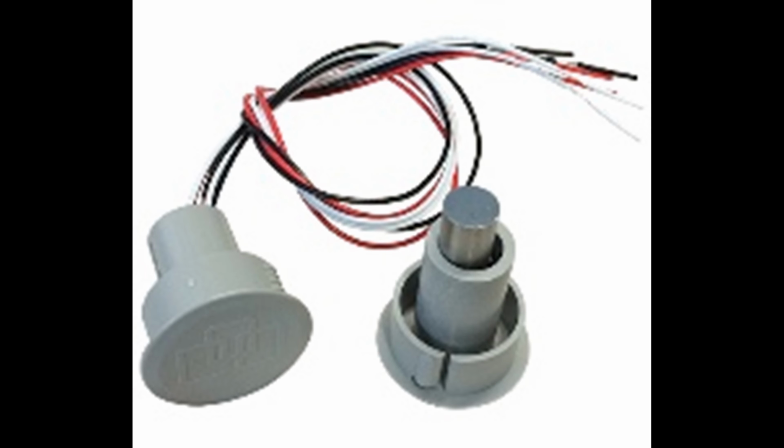Okay. All right. That's what I was wondering. I didn't know why it had that, but that makes sense. It's double pole. That's the reason why it's got 6 wires. But like I said, the common will go to the power supply, and then I'll use one of the others for the trip leg. That's what I'll be doing. Absolutely. I think that's exactly correct.